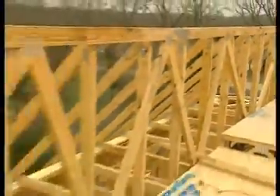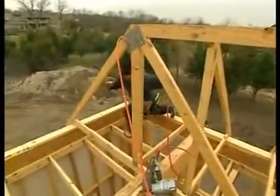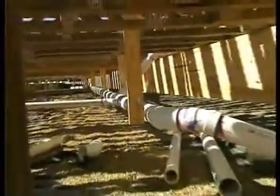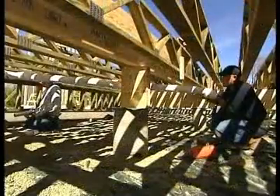There are other benefits to building with trusses as well. If the homeowner ever wishes to remodel, the possibilities are virtually limitless since the home doesn't require load-bearing walls. And since we use open-web trusses for the foundation, rearranging the plumbing or fixing leaks becomes a relatively simple and inexpensive procedure.